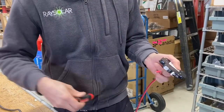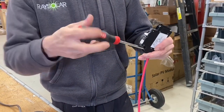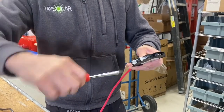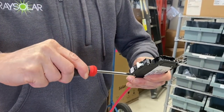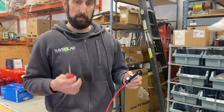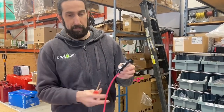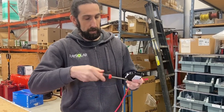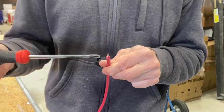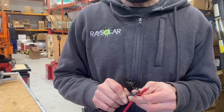Let's take the bottom side of this breaker and clamp this down. If you're asking what the torque should be — all electrical equipment will have torque specifications, and you can use torque screwdrivers, or if you're experienced enough, you can judge by the amount of rotations and the feel of the fastener. Now, we've clamped this nice and tight. But if we pull this wire out and take a look, you can see the wire got compressed — because it's fine strand. This compression issue is impossible to achieve the same way with a more solid core strand.